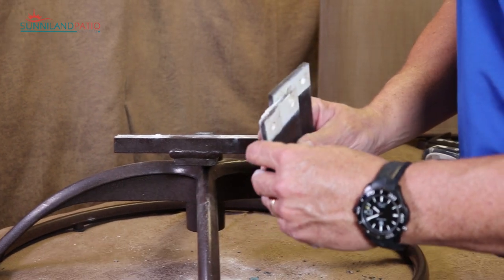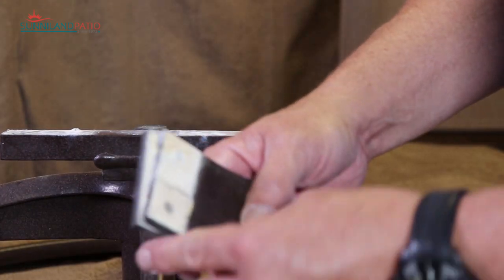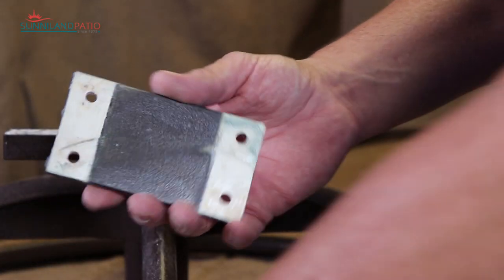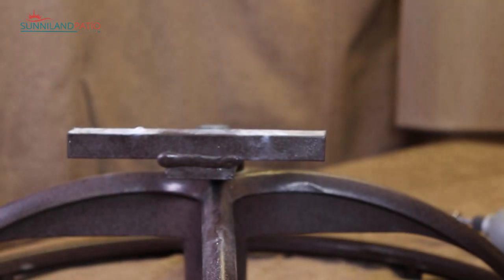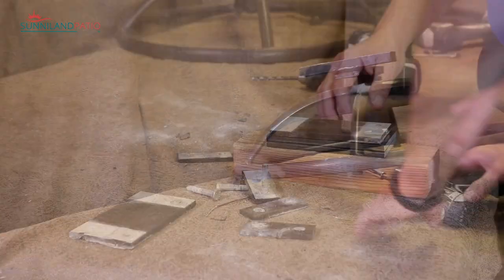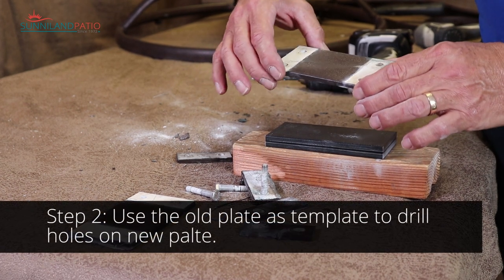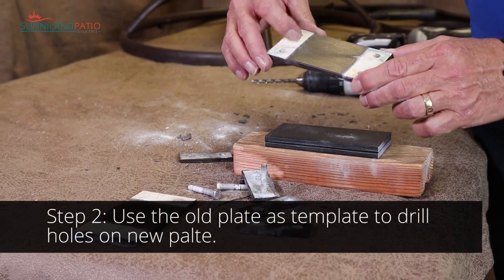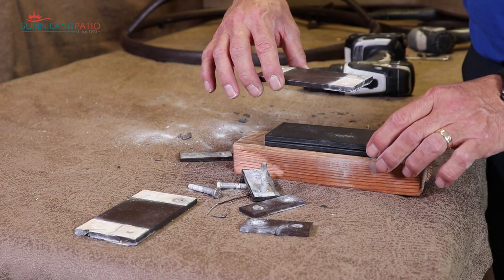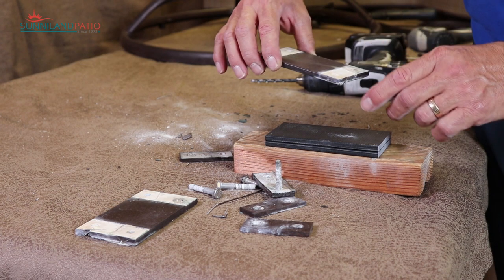We've got these old plates — don't throw them away yet. There's some of the cracking I was talking about that you can see on these old plates. You want to definitely keep one — keep your better plate of the two. We want to use that old plate as our template because the hole patterns can be different from company to company. You need to make sure it's going to fit within these other parts and then back onto your base.